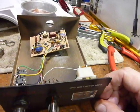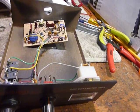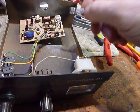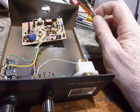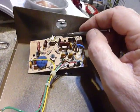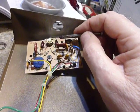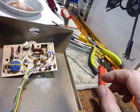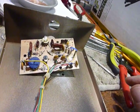I picked this up real cheap and was all set to use it, hooked it up, and it didn't read right — the wattage didn't read right at all. I thought I'd have to calibrate it, so I took it apart, took the case off. Then I looked at it and thought something isn't right — this toroid back here should have two turns of wire going through around the edge of the circuit board, and they only had one turn.